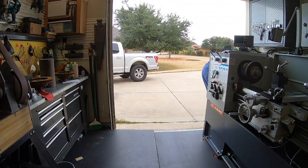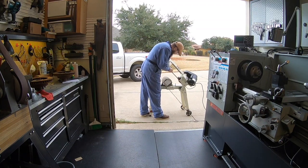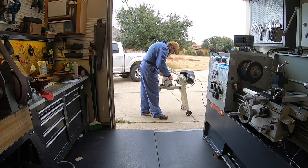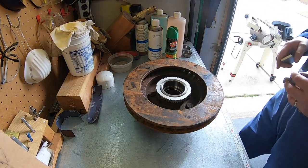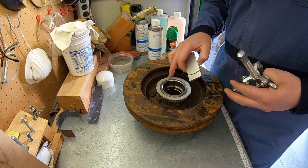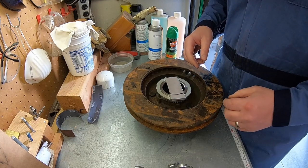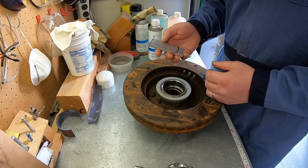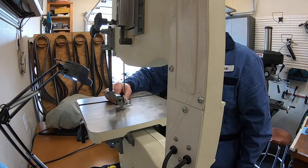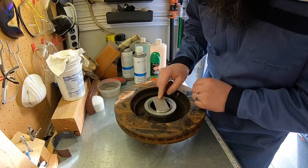While the saw is cutting, I've verified a few measurements on the drawing to make sure everything looks good. We need to get these ABS gears pulled off. I'm going to throw this in the bandsaw, cut this piece out, put a puller on here and see if that's enough to pull it off. If not, we'll get the torch and put a little heat on there. We'll cut a quick radius on there, touch it on the belt grinder, and that should give us enough clearance.